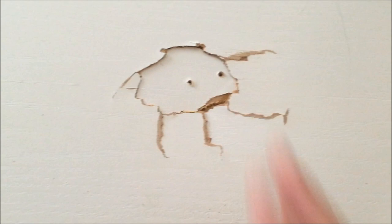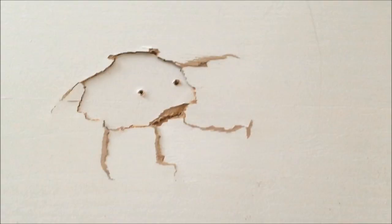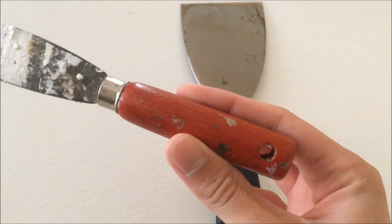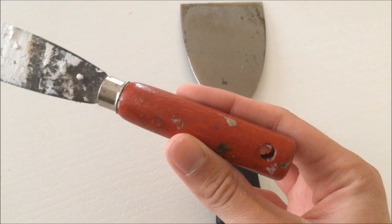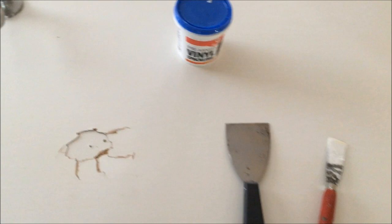I've sanded these down the best I could just so they're flatter, and vacuumed up the sawdust. I pulled out the screws, so those holes are left to be filled in, but I'll go over that to make it entirely level. It's time to take some spackle or wood filler — just depends — and fill it in. For that job I have this narrow old scraper my parents have had forever, and a regular much thicker wide scraper, and I'll just go over the whole thing.